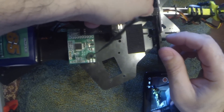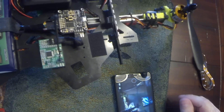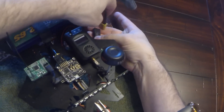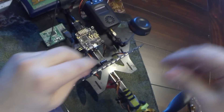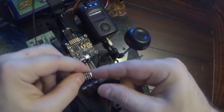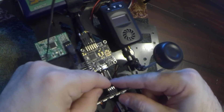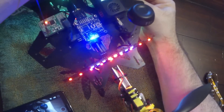I don't want to stick it in backwards — I think that's right. The Atmel chip just runs the NeoPixels, if I've done it right. Oh — I plugged the chip in backwards. I think I blew it. Yeah, it's pretty darn hot. I'm going to stick it in the right way and see what damage I did. Oh cool, it fires up!